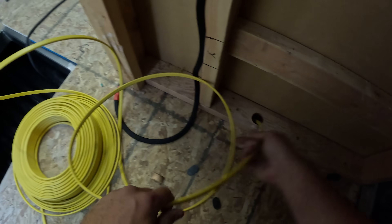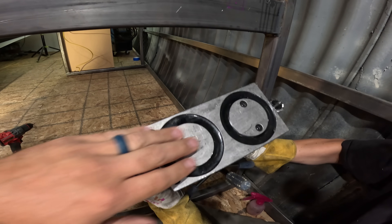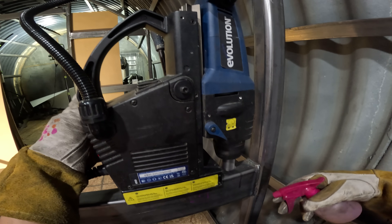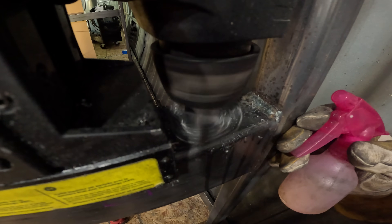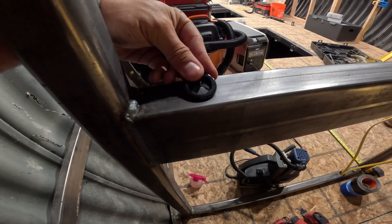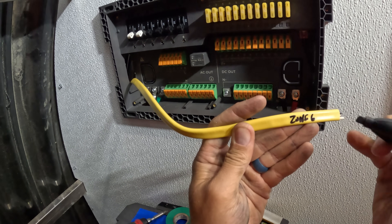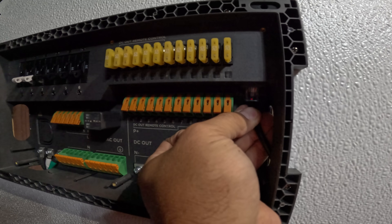All the wires run through those gutters and then up into the walls we framed, just like in residential construction. We've cored out large holes in the metal wall studs with a mag drill. The mag drill uses a very powerful electromagnet to clamp itself onto a metal surface and brute-force its way through thick pieces of material without much human effort required — just electricity. Romex gets pulled through metal studs and metal conduit every day, but we added rubber grommets to the inner edges just in case. Safety is always a good thing. All the wires come together inside of the normal breaker panel.